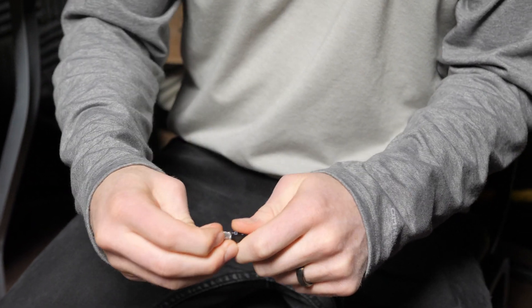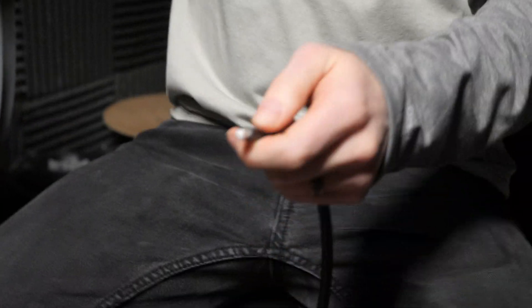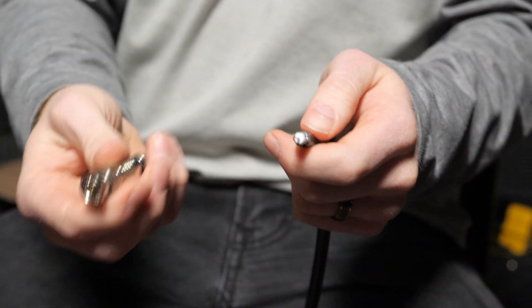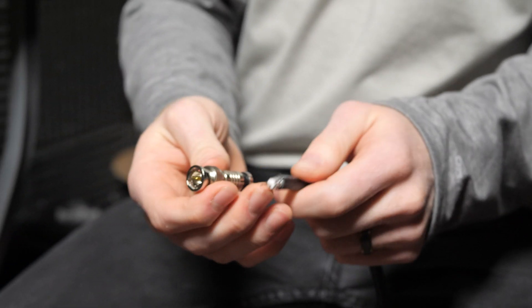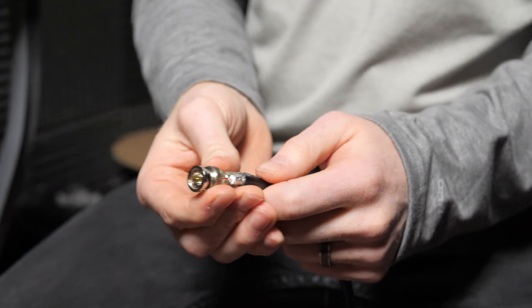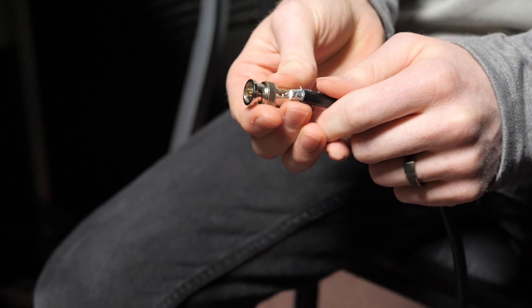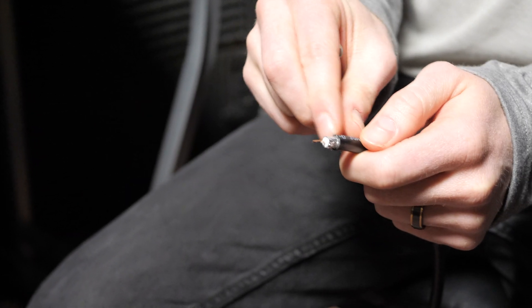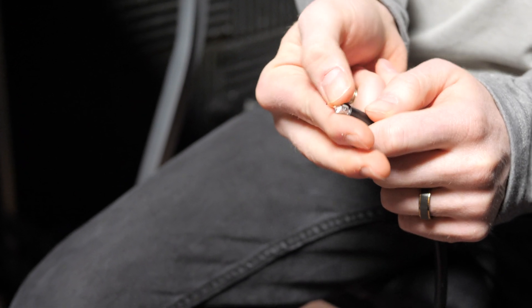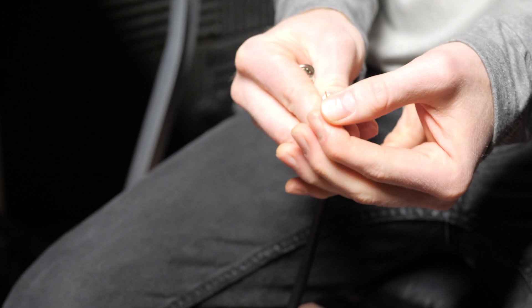Make sure that the gold foil comes off so that it reveals your copper tip. The cool thing about these BNC compression connectors is that you can also use them as a measuring device. You want your copper wire to be roughly the width of this band right here. As you can see, we've got about that, and then we want a little bit of the gold foil right here. We're going to pull it back so that it doesn't get stuck as we put this thing on.